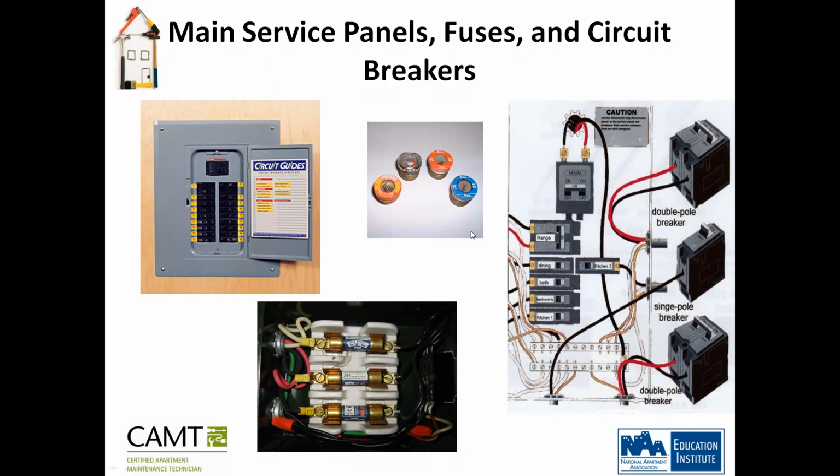And for example, I know it shouldn't be done, but let's say the actual breaker for the dining room is off, but the main switch is on. Does that make it safe to work in that area, or do you need to switch everything off? If it's actually lined up the same way it is here, then all you have to do is switch off the dining room. Oh, okay. In a lot of instances, a lot of these things are not labeled properly. I will go ahead and shut all of them off just to be on the safe side.